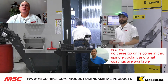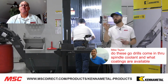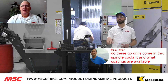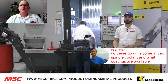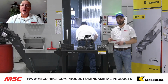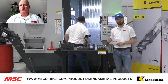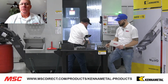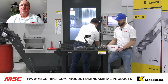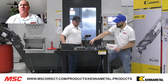Very good. And we have another question. Mike, thank you for joining us. Thanks for leaving your question. Mike's question is, do these GOdrills come in through spindle coolant, and what coatings are available? Well, the coating is actually a KC7525, that's the coating on the drill. It's the same on all the drills; we don't change it up on the GOdrill. And they come in 3 times, 5 times, and 8 times D, so the different lengths as well.